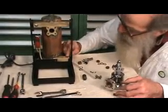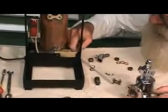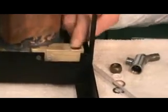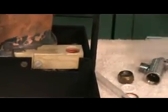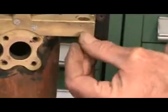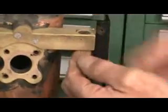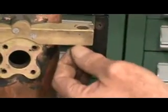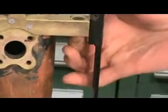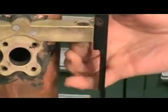Now I really like this approach because with these silicone rings, you take two silicone rings instead of the single flat one. Some of your machines may have a little brass washer that acts like a bearing, but it's not really that critical. And I push these into place. Once again, I'm kind of out of position here for the camera. I push the rings into place in the sockets, upper and lower. Everything is clean and ready. This is a 1981 machine that I've removed the asbestos from the boiler with.